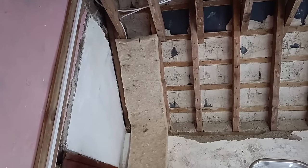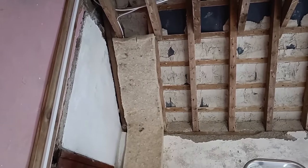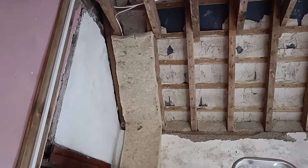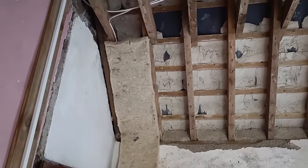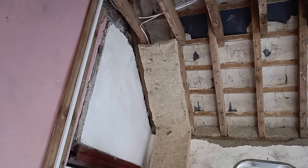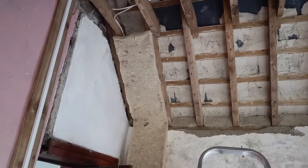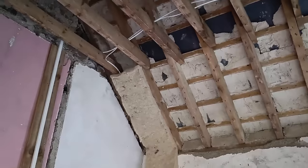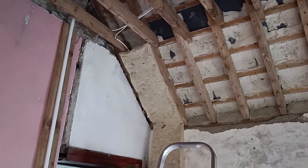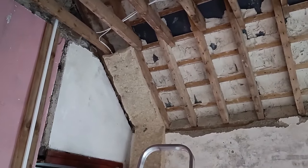We're not sure what the plywood's going to look like. My thought was we also staple the ply to the rafters, but with 14 mil staples, the ply is 5.5 mil. That gives us 9.5 mil of staple left, and we know 10 mil doesn't go through the insulation. So that's, you know, it's a live and learn process. So I'll do exactly that, live and have a go and learn along the way.